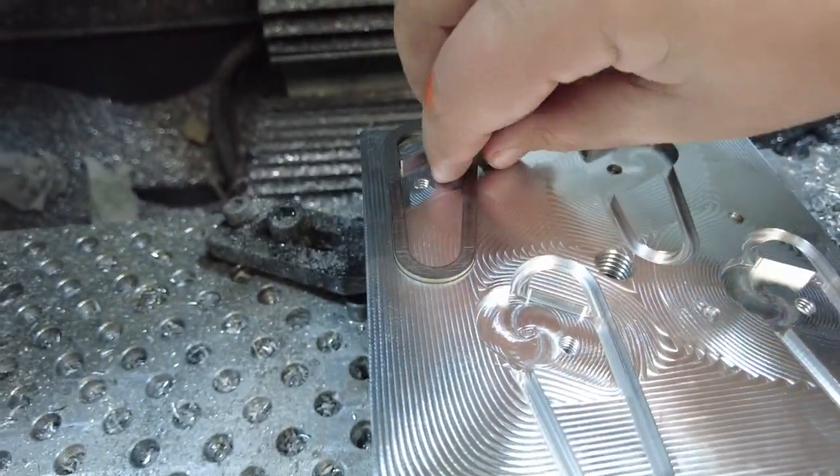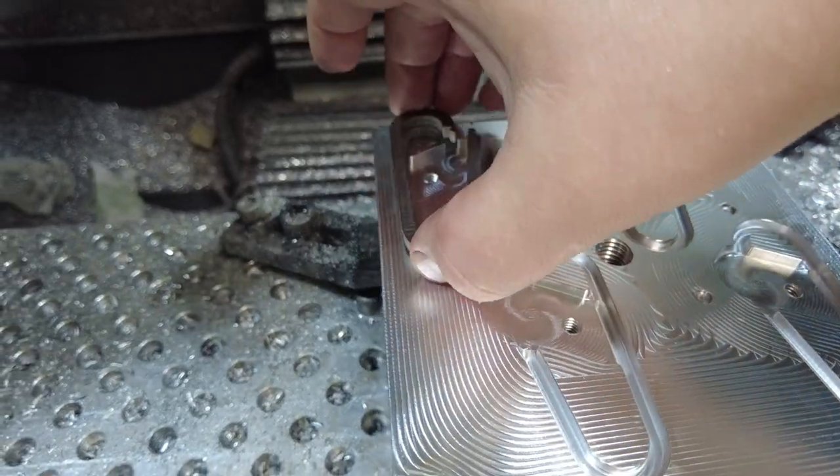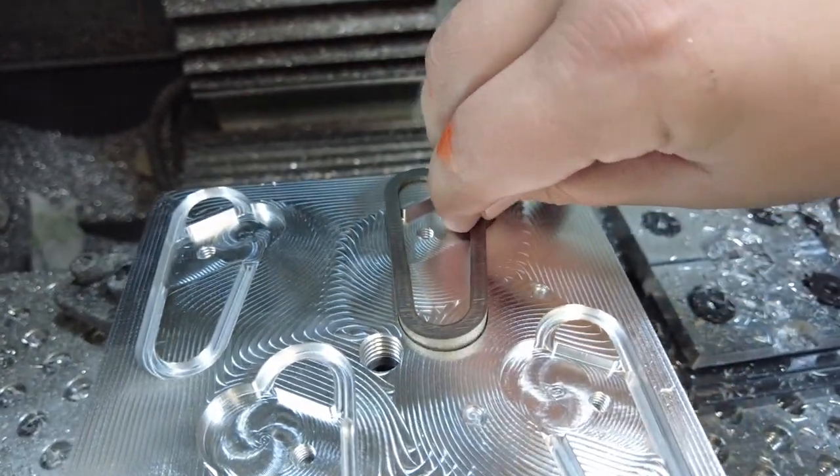That one fits there — interesting. This is where they're mirrored onto the other side. I would be willing to bet that the laser-cut parts have just a little bit of taper on them, which is why they fit on one side but not the other. In the future these could be nested either way when they're laser cut, so I need to make sure they fit in both orientations.